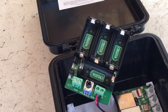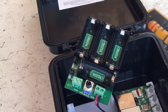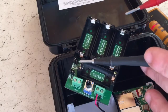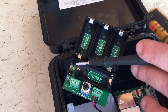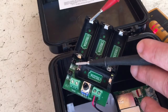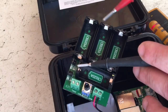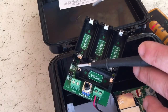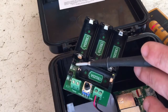I'll take the meter and work through each terminal. Starting with the black lead on this one and touching all the minuses — you can see that one is connected, but this one isn't, and this one isn't. So I know this terminal is in series with that one, and I do not want to hook my battery to those.